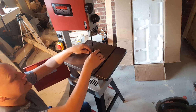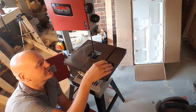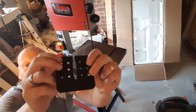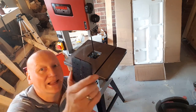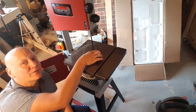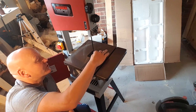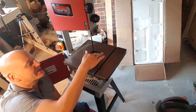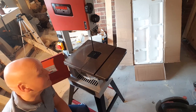We've obviously got this waste plate for when you change the blades to remove. It is plastic. It does wibbly wobbly. May get changed in the future for a wooden one. You have to make it a good fit when you push it in, but you've got to make sure everything's down below the surface or at least level with it, because if you don't push it down far enough it sticks up and you'll start having problems trying to push your piece of wood through.